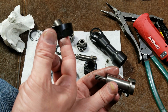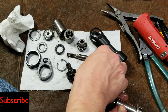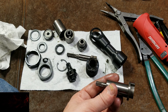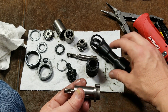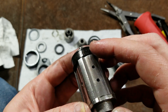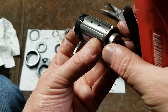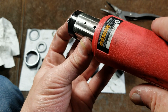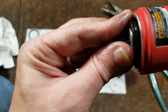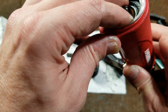What I'm realizing is this ring is a lock ring. Once you screw this down and get it torqued properly, this ring is meant to prevent the collar from rotating back and forth when you screw this on as well as during operation of the ratchet — and it provides a little ability to adjust it so the head is pointing in the direction you like. Here's our little alignment post right there — that's what's going into this slot. It's effectively idiot-proof: the only way the air motor properly goes back in is if you get everything just right. The alignment peg means it just slides right in, no problem.